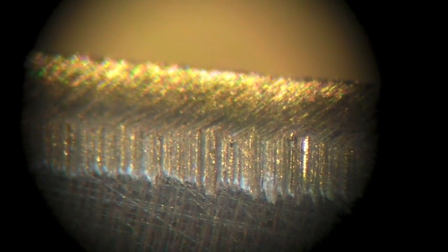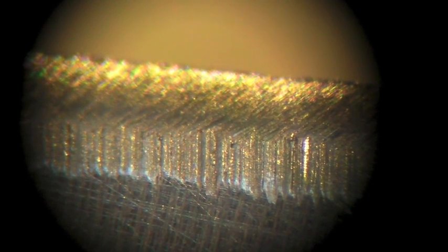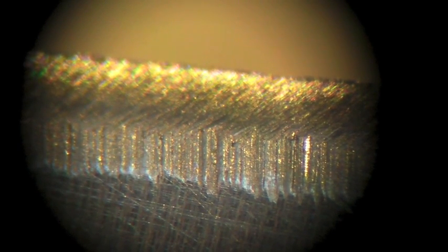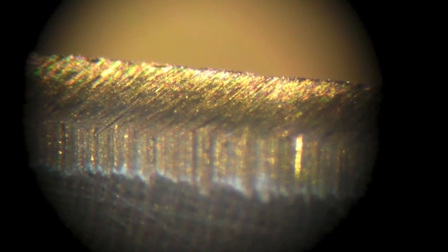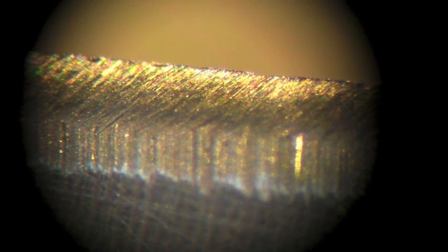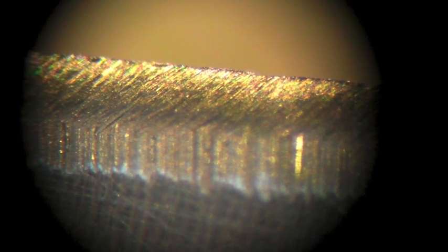And the shining part, silver coloration — the rough scratch line is its primary bevel. And over there you can see the yellowish shining: that is the deeper angle edge. This is my Sharpmaker 40 degree edge, which is very much deeper than the original edge. That is the reason, I guess, for this unsharpness.